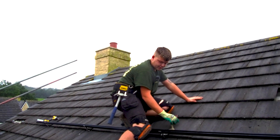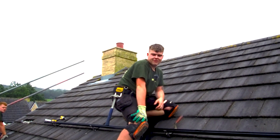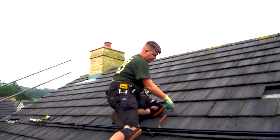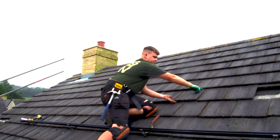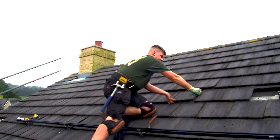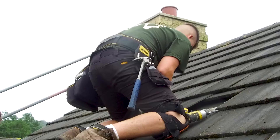What are you doing right now on my roof? So we've got to put our clamps on underneath the tiles to get it fixed into the rafter. What we've got to do is lift the tile up, locating the rafter which is here, and because the nail's up here we simply just twist and lift up — and then that's our rafter.